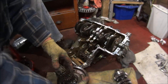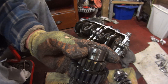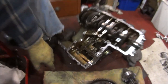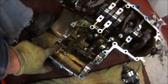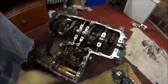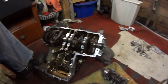And it does have — where is it — just there, there's a little hole in the bearing which locates on the little pin inside the engine. Hopefully you can see that — there's a pin there and a pin there. So make sure you don't lose those, and make sure when you put the engine back together all the bearings line up, otherwise the crankcase halves won't go back together properly.